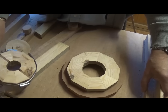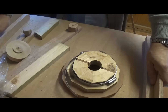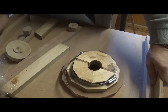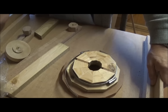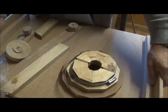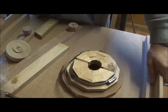Accuracy, a bit of patience, take your time, and a good sharp blade. If you haven't got a mitre saw and you haven't got a table saw, yes you can cut them by hand — you'll have to make yourself a little jig first and it's going to take a while, but don't be put off. If you haven't got hardly any equipment at all, you can still do segmenting. The only one I wouldn't recommend is cutting them on the band saw, because you can get a little bit of waviness with the blade — you might be off a little bit and then you'll end up having to sand every segment, which can be a bit of a pain.